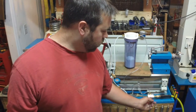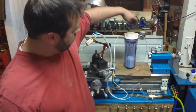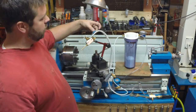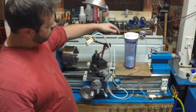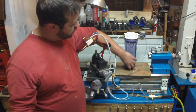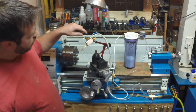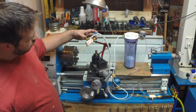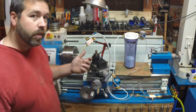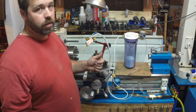I bought 20 feet of tubing. It's a single block to split the air coming in — one line goes into the coolant tank, the other goes straight to the head, which is why there are two lines. The tank is being pressurized at the same time as the head; the pressure builds up and forces the coolant up and out through this hose to the needle valve.